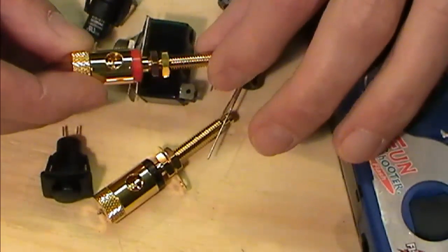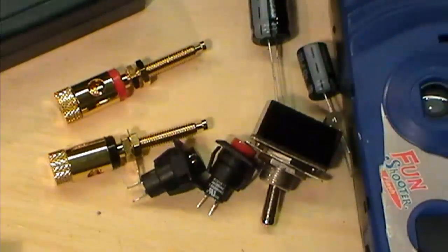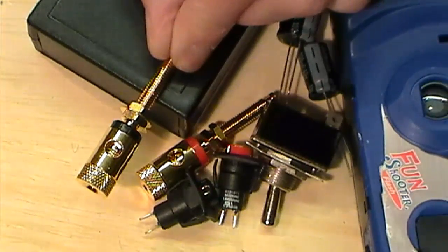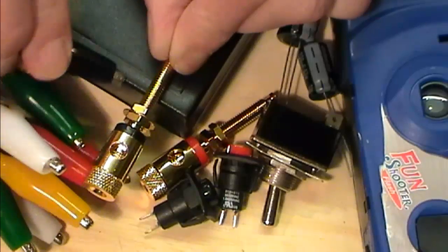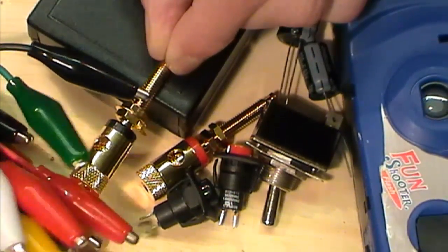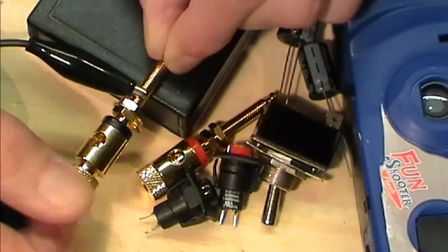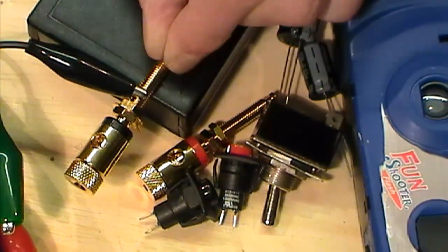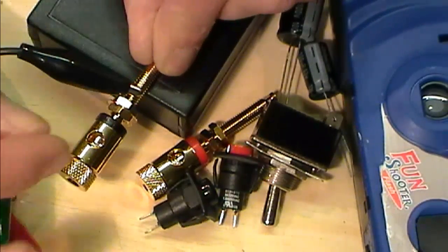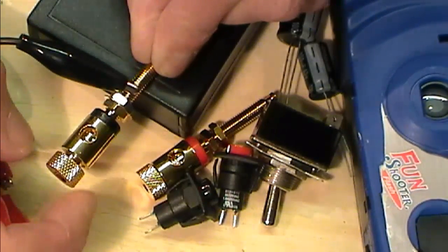I've got some gold-plated posts here that you need to take a feed off your box for your meter leads and this, that and the other. These little gold-plated posts were about £1.50 from Maplins, and I aim to recess them ever so slightly, so I can get a crocodile clip on the base here to go out to my multimeter to get the reading of the charge, and another set of crocodile clips that I can unscrew, get them clipped in on the top, and get a really good contact for my sparky things. I may well even use one of these. I'll try and adapt one so that it wedges in there permanently and can sit up and hold one half of the wire, then I can unscrew that and take it out when it's not in use.